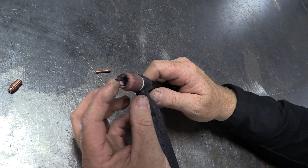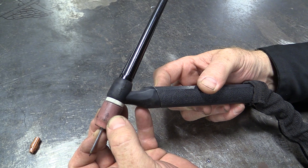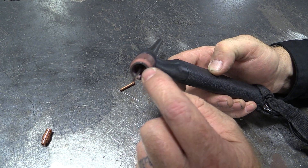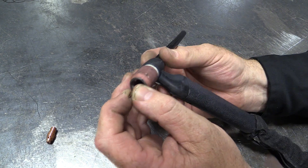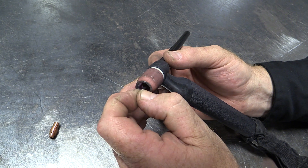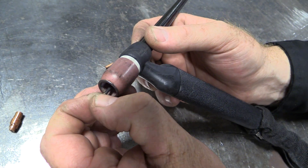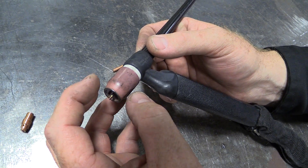A common question is how far the tungsten can stick out of the nozzle. If you look at these nozzles, this one has the number eight on it — that is a number eight nozzle, meaning it is eight millimeters across. The number on the nozzle is the measurement in width of the hole in millimeters. The rule is: the tungsten should stick out no more than the width of the nozzle. So for an eight millimeter nozzle, you can bring your tungsten out eight millimeters. If you extend it too far, you'll lose gas coverage and get porosity in your welds. If it's too close, you won't be able to see the puddle because the nozzle covers it up.